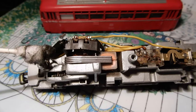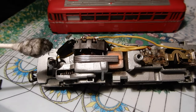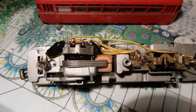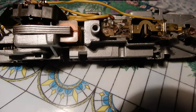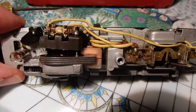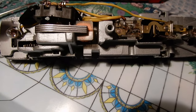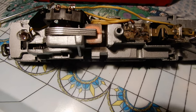Why is it important to remove the carbon? It's because all this powder conducts electricity, and instead of going through the normal copper wire which is designed on the rotor — you can see it a little bit here — it goes outside, and all this powder means basically the rotor is not working very well.